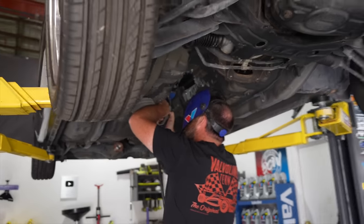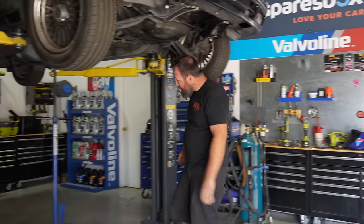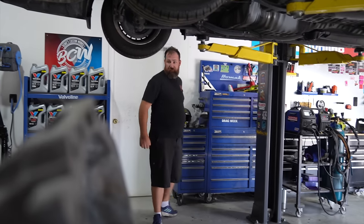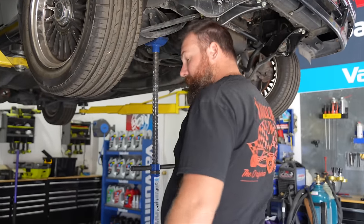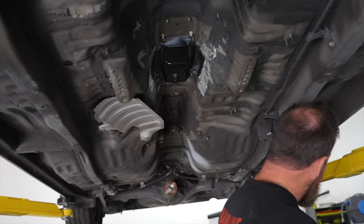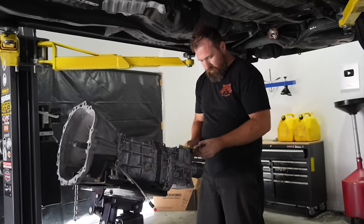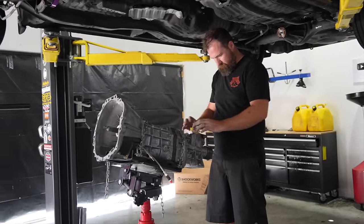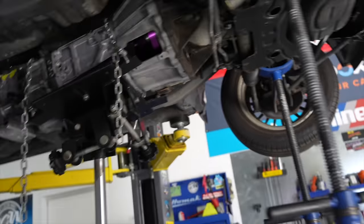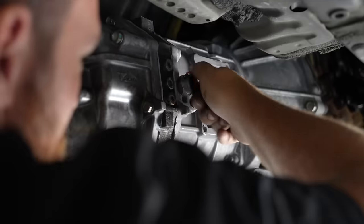Do you want to get on the inside of the car looking for fire? We'll just not say the F word. We'll bring it down to make sure nothing's on fire — as long as that's all good we'll put the box back in. Like now it's in there, it doesn't look out of place. Now that I've got those back in we can do our final test fit. The tunnel itself is not wider, but the shifter housing is wider if that makes sense. I do have to notch this for the reverse lockout cable, but I'm not going to do that until later. Just got to put the gearbox in fourth gear. Just putting two bolts in — two is a lot more than zero.